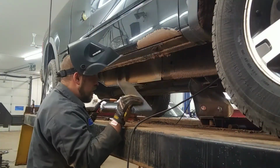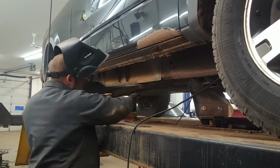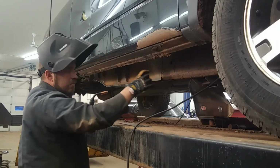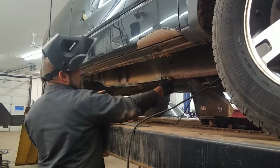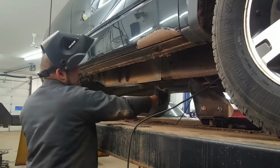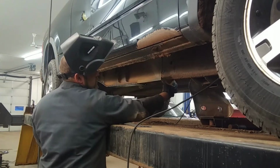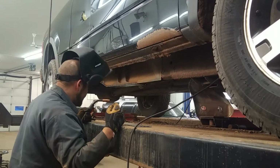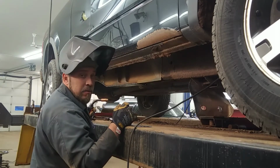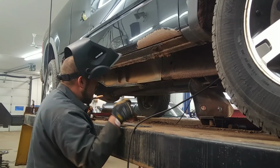Alright, folks. This is the last piece we're going to put in on this side. That'll finish off the plating on the bottom of the frame. It extends past the seam by about 3 inches. We're going to wrap it because the bottom of the frame is tapered there. So as we weld forward, we're going to pound that up to match the contour of the frame there. Then we'll give you guys an overall view of what we did on this side. We'll wrap this one up, and then the next video we'll move on to doing the driver's side.